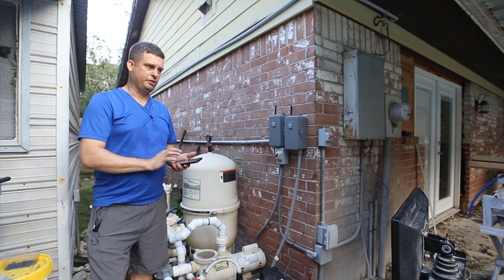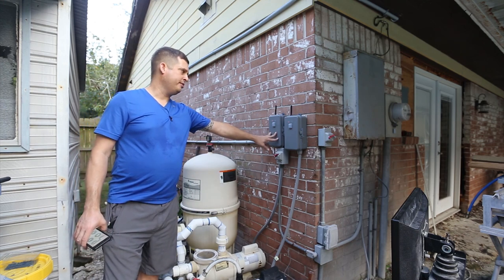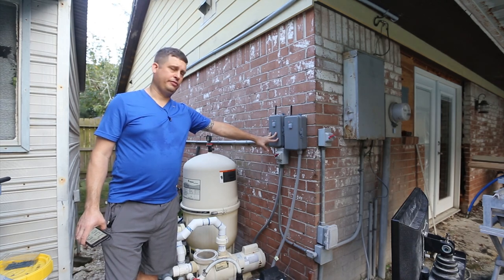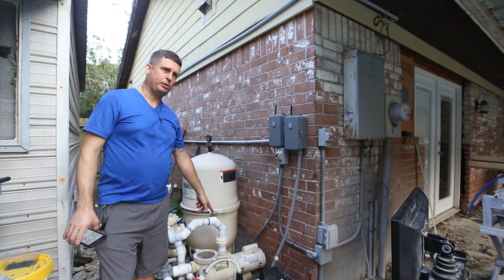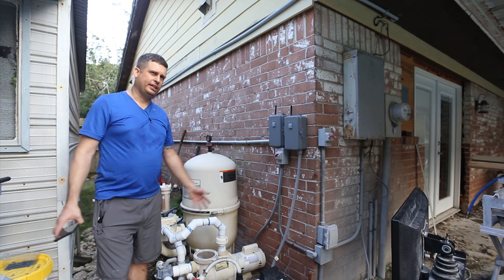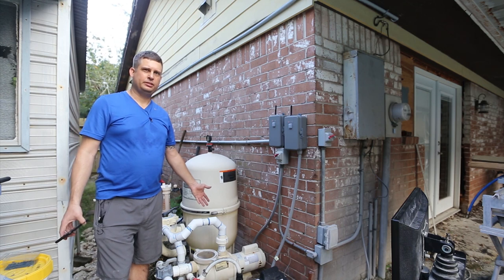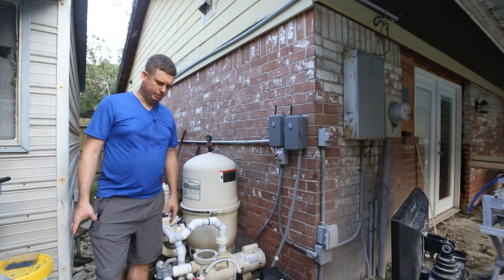Thanks for watching. These were $163 a piece on Amazon.com — it's a GE 230-volt smart switch that is Zigbee enabled. One of my next projects is to replace this one and a half horsepower pump with a three quarter horsepower pump. I thought about buying an Intellipump, but what's the point of buying a one and a half horsepower pump and then using a computer to slow it down? I did the calculations and a three quarter horsepower pump will use half the electricity and still pump the same amount of water.